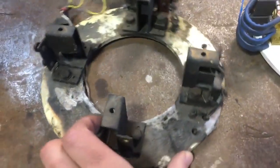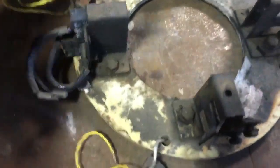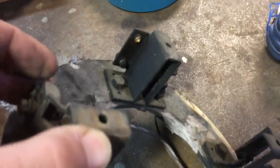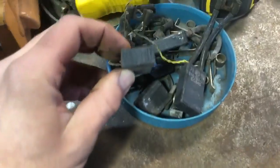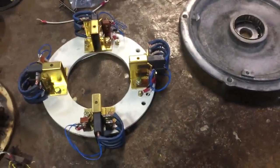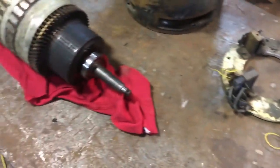One of these brush holders is really toast. That's the brush holder where some of the brass is actually gone — it's supposed to look like that but ended up looking like that. The old brushes are scorched and some have quite a lot of pitting. It was obvious that the motor needed a new brush holder and new brushes. I was able to find those on eBay, thanks to NashLift, for a reasonable price, along with new bearings front and back, and now I've got it all apart and cleaned up.